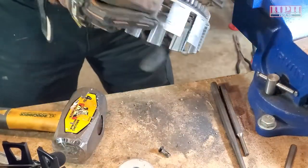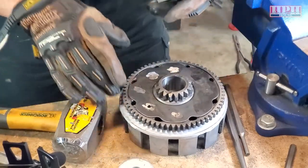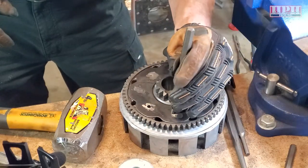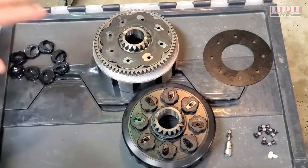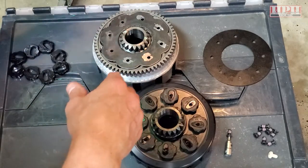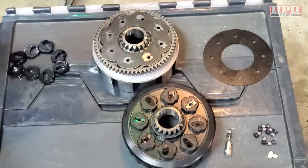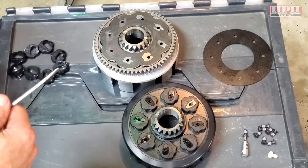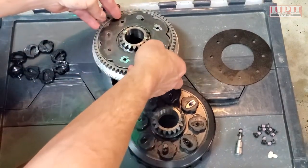Yep, that's it. You could use a press of some sort also if you have something like that, but just beating them out of there seems to work okay. To remove the rivets, it's easiest to — after you grind the heads off — put it down on a very solid surface like your garage floor, something very heavy and solid, and then just beat them out with a punch and a really heavy hammer. They'll come out, not that big a deal. Or use a hydraulic press if you have one. Here's what remains — pull this plate off.